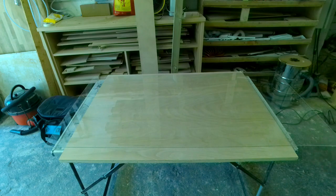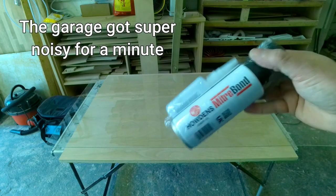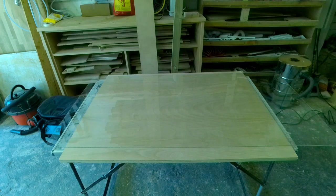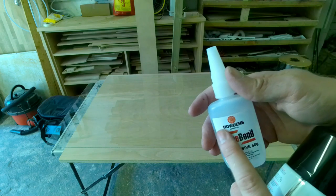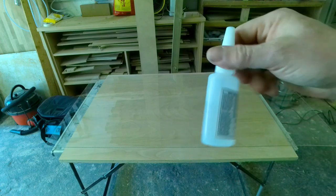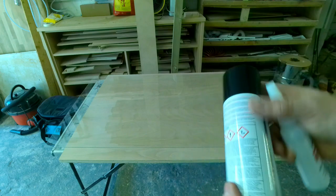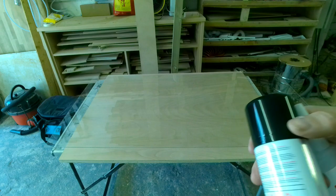Anyway, the glue that we're going to use to hold it in place is one of my favourite glues. It's Mitre Bond. This is made by Unica. This is Howden's branded, but you can buy this from Screwfix. Like I say, it's Unica. I'll stick a link below. You can get it off Amazon, Screwfix, a lot of places. But what you're looking for is this little area here. That's the Mitre Bond. It's like a gel style super glue, and it comes with an activator. So you put the glue on and then you spray the activator on, and it sets within seconds.